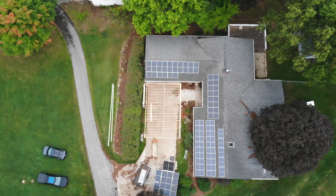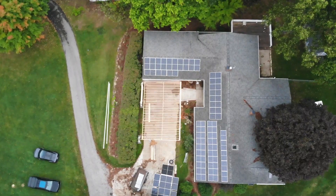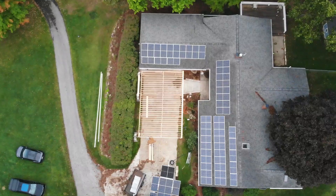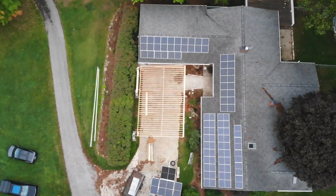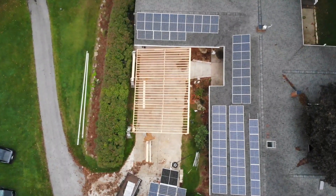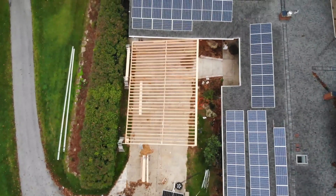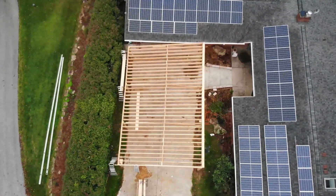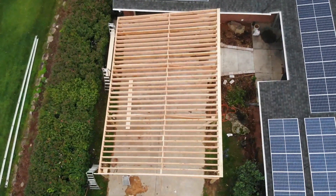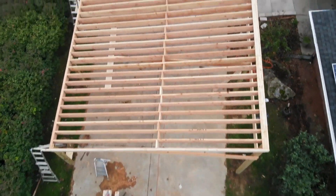In the next video I'm going to add up all my solar. Up on the hill to the right, I have 26 panels — it should have been 27, but I ruined one. Each panel is 330 watts — those are the panels from the solar trailer version too, check it out. The lower right are 25 280-watt panels, the first set I had. The other ones are 440 watts. Those are my three strings into the existing three EG4 6000XP inverters.